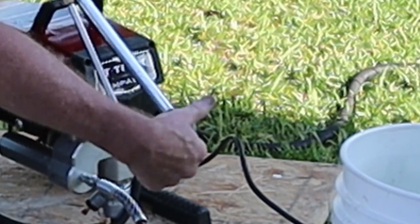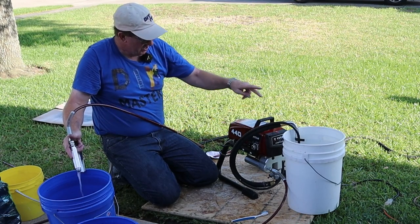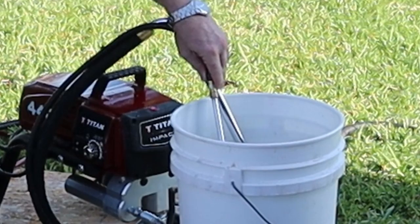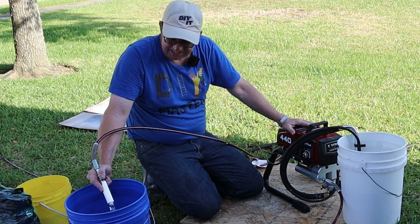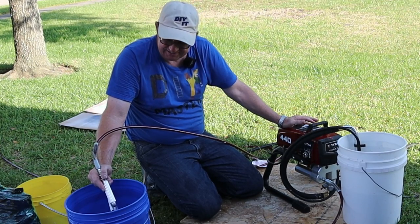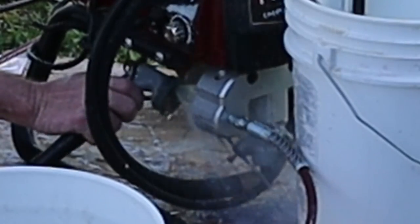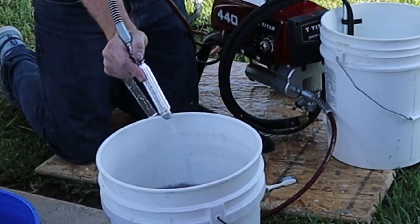This filter comes off. Remember, it takes roughly a quart of water or paint to get from the machine to the end of the hose. So you won't know you've got it clean until you get a quart through there. You can see it's getting much cleaner. All I'm doing is running on prime to get the paint out of these tips. I'll let this run a minute, get another bucket, and that ought to get it clean. When I go to get the clean bucket, I'll take this filter off again and clean it one more time to see how much stuff is still in there. I always let these parts sit in clean water so any paint left on them doesn't dry out before I get it cleaned.